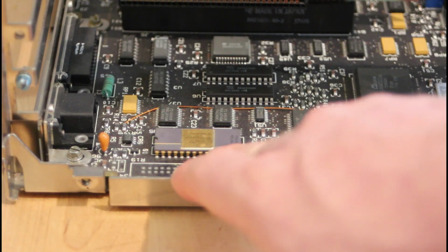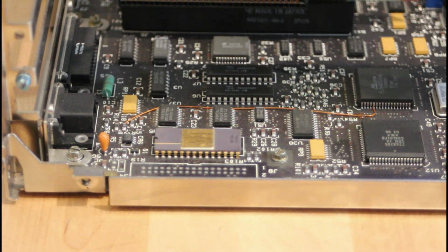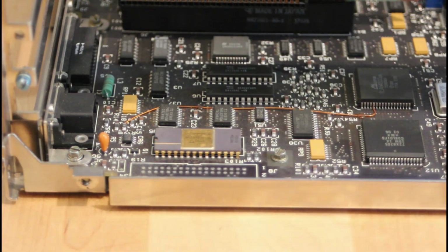Now you have to be a little bit careful about calling this palette registers because although that may be fair terminology for MCGA, when you get to VGA, palette registers refer to something else, and so I tend to call these the DAC color registers.